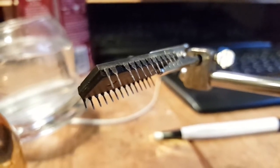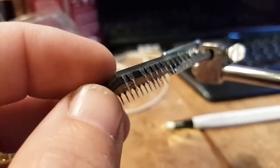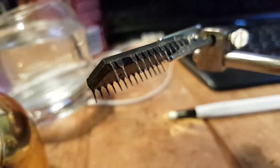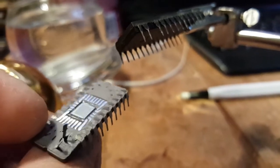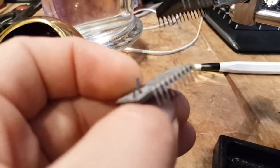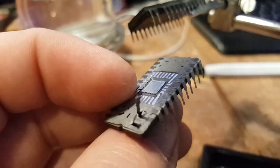So let me show you how I repair this leg. There's still a little piece of metal here sticking out of it. What I'm going to do is take a leg from this chip here, which was one of the ROMs that was broken on the PCB. I've pulled a few already - there you go - one of the legs, and then I'm just going to stick it on there.